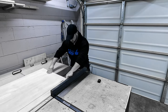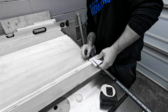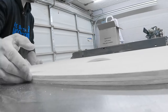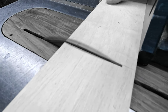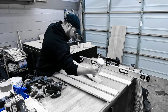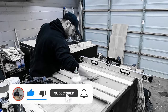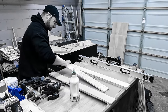Now I'm simply just ripping down strips for the front and back walls, or fence - however you want to say it. I'm using half-inch plywood, so I'm just ripping four pieces up and gluing them together. I'm also using the Katz Moses stop block. I want to incorporate a lot of other features in this sled to make it most efficient. Here I'm gluing up my strips - I use Titebond 3 and it works great. I also use the level to make sure everything is as straight as can be. Just put your glue on, give it a decent amount, and then spread it all around to make sure it's nice and even.